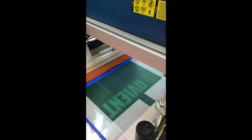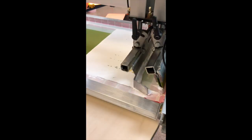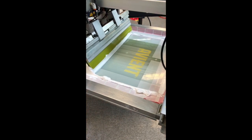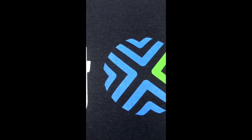It's very important to have optimized print parameters when you're printing the color over a white plate or directly to a white garment. The white provides a nice underbase. We keep the flash low, and as you can see, we get good color.